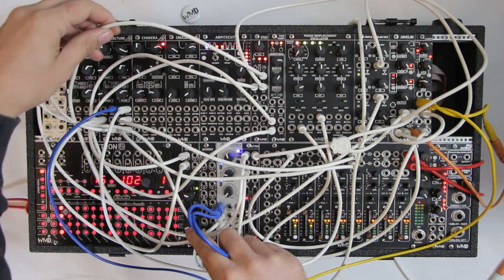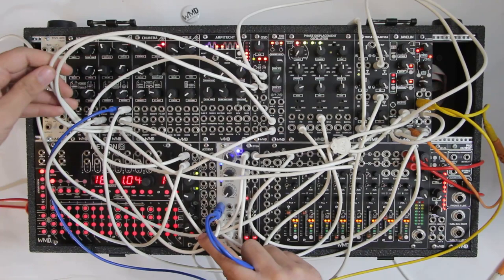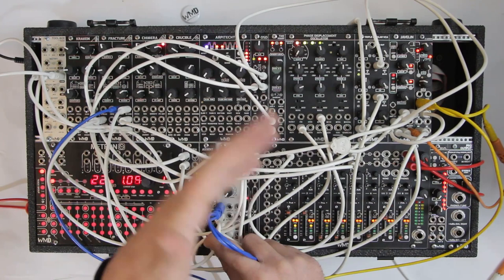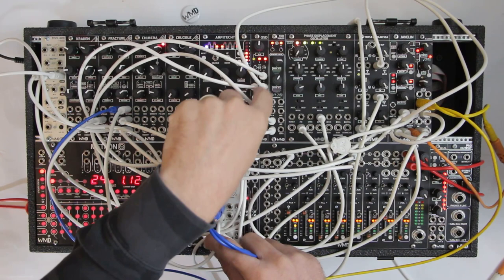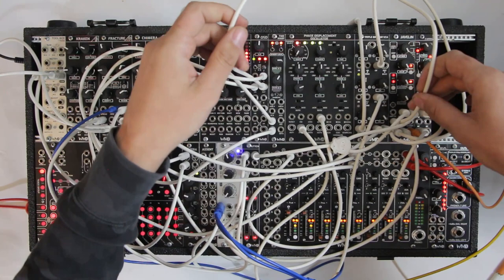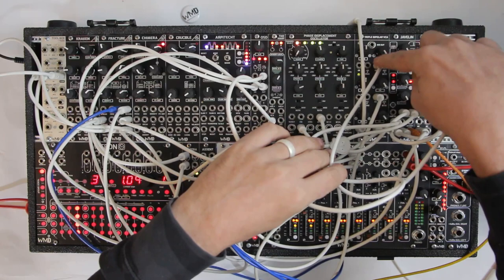And we've got OSD ORing with another signal. And this signal is coming from the Volterra, which is running through Time Warp, just to kind of slow it down a little bit. So we're not getting super fast jolts. But we're just ORing those two signals. And basically what we're going to do is that's running out of the OSD. That's running into the Javelin's VCA and then into this input on the triple bipolar VCA.